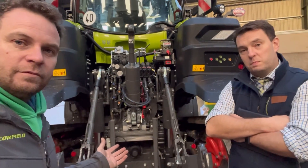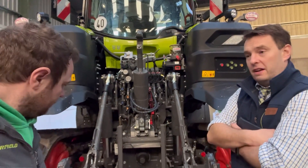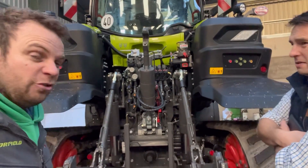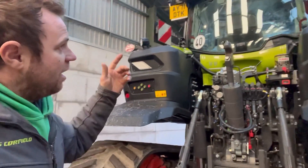It's standard PTO like a normal tractor, so it's about 450 horsepower at the PTO. Engine-wise we are looking at 450 horsepower, and because of losses going through the back end on the transmission you'd lose a little bit, so you'd still be looking at a creditable 400 on the top end. You wouldn't lose a heck of a lot - so if you had a massive wood chipper that's the kind of power you'd use for that. You wouldn't want it on the baler.